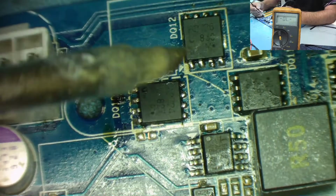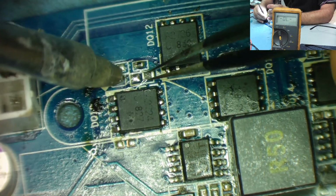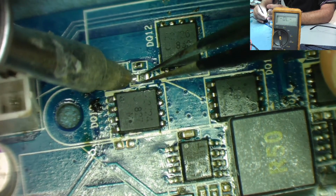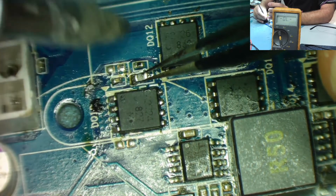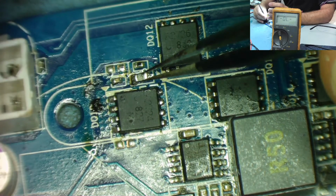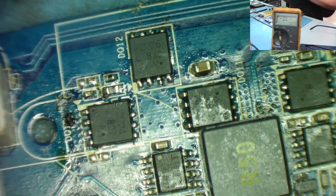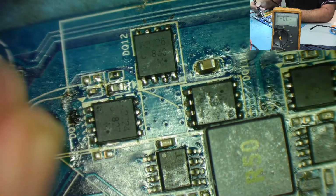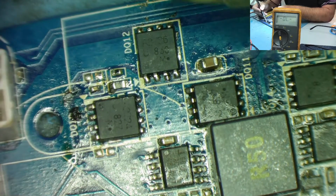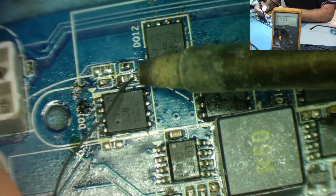So soldering iron in from this end. Resistor. Melt with a bit of fresh solder. I should just slide this in place, there we go. Slightly crooked, but it's good enough. No, it's pretty straight, that is. Okay. So that's got one of them. That's our 2.2. So we can just check now. They should all be present and correct now, on each channel, each phase.